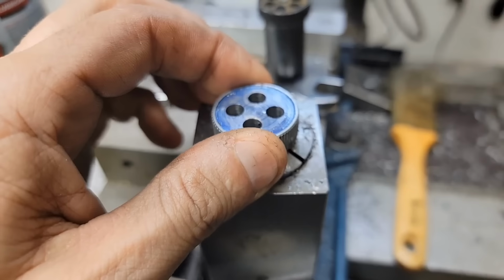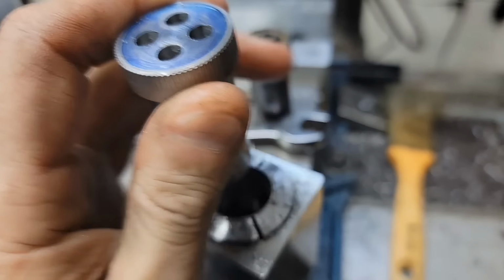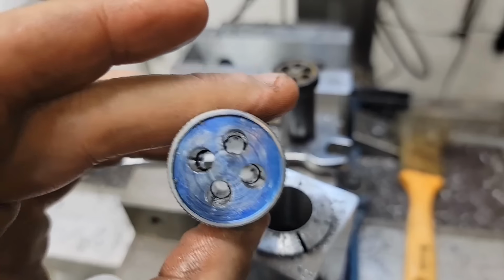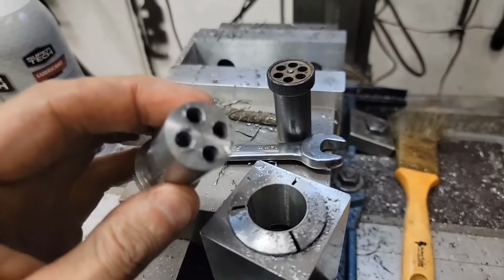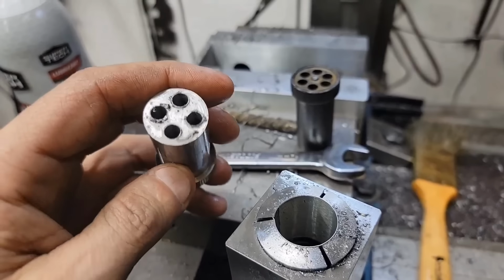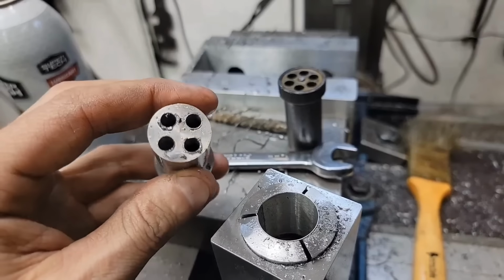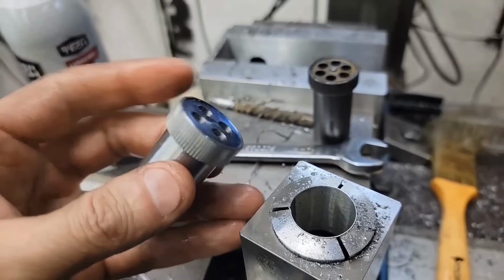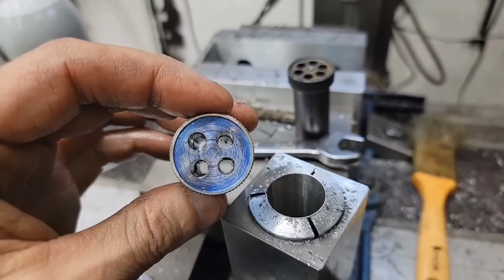All right, we're out of there. Just loosen this up, set it down. So you can see I kind of rough chambered with a bigger ream. Whoa. A blowout there, but looks like they came through pretty straight and squared out, so yeah, nice. I'll clean that up a little bit, actually get a chamber ream in there, and then push a rifling button through it.